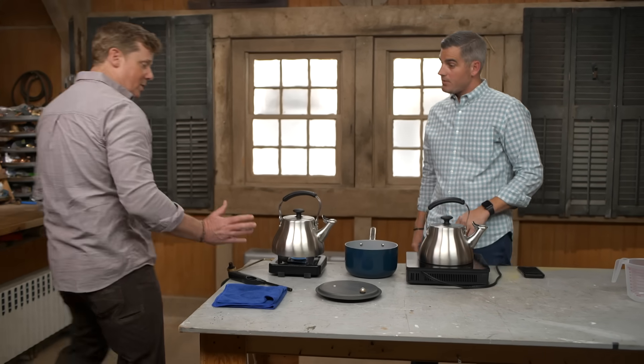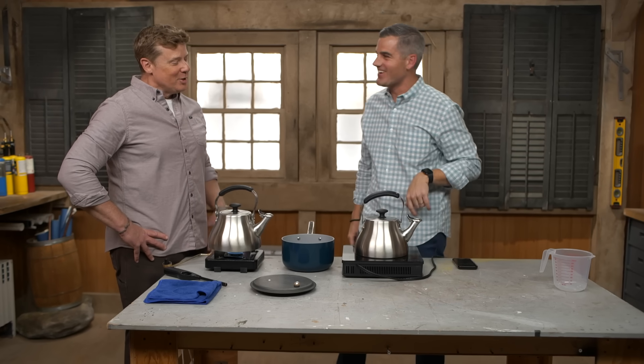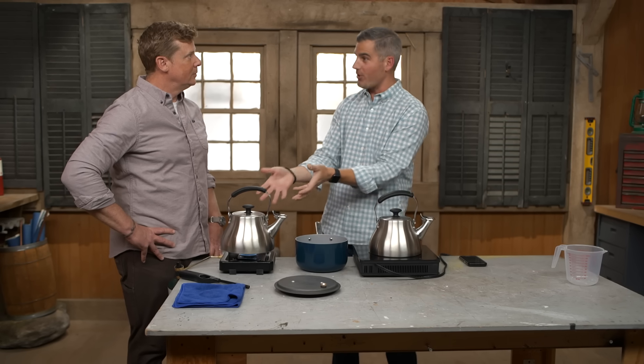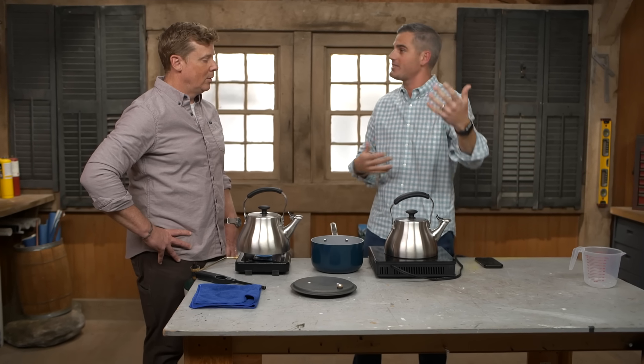So cool, right? This is way more efficient — this will boil water twice as fast as gas. So we like the efficiency, and it lends us some other things. We've got to put hoods over stoves, and with the big gas burners we put in now, the hoods are huge. You've got large hoods, a lot of ventilation air. You've got to exhaust all of that heat and all the byproducts of combustion. The poor air quality has to get out, and then you have to bring in makeup air to offset that, so you don't depressurize the house. With induction, you can put in a very modest fan — less than 400 CFM — and you can exhaust that. You don't need makeup air.